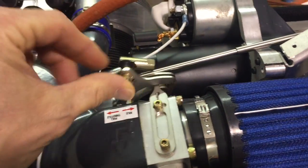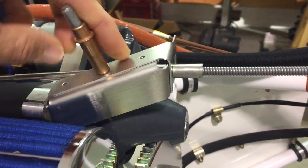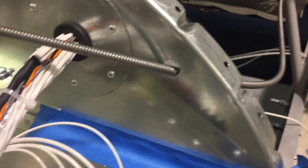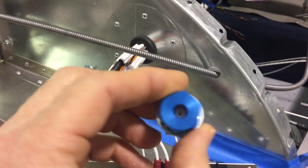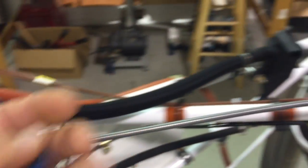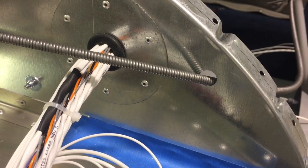Here's the throttle. This little piece connects to this rod here, gets secured in this little aluminum piece, and then three rivets get put on top. I'll put two clamps here to hold it and then it comes back through the firewall. The reason it isn't complete yet is that I bought one of these firewall exit fittings for a nice professional look, but it doesn't fit — this part goes through fine, but the big ferrules on the end of the cable do not fit through. So this thing is completely useless and I need to figure out another way, maybe just a rubber grommet sealed with some high-temp RTV, before it runs back into the panel.